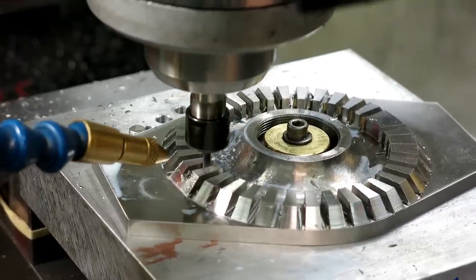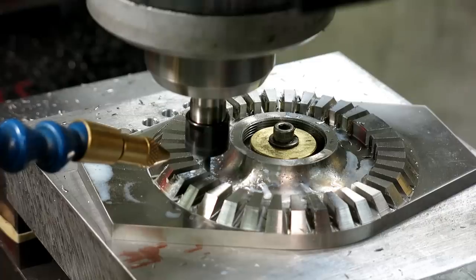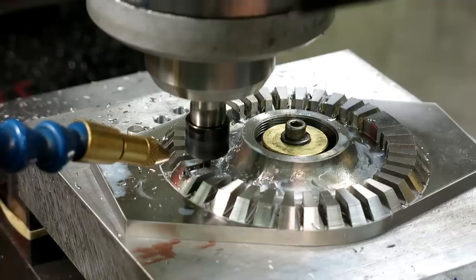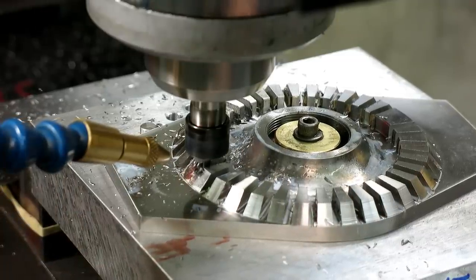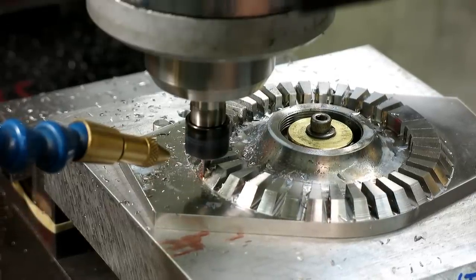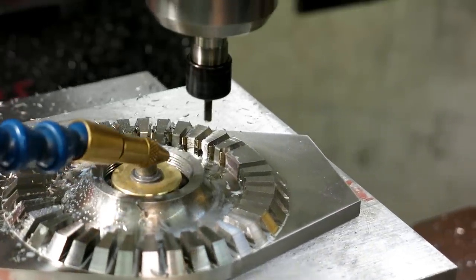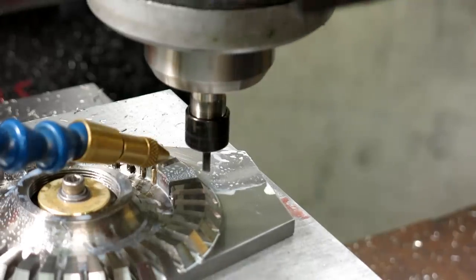But, now I actually tried cutting it full depth and it actually works, but on the actual piece here, I wanted to be a little more conservative, just in case, because I got a lot of work in this thing. Okay, so I'm taking it in two whacks, about equal depth of cut. And the chips are beautiful, just marching through that stuff. This is 304 stainless here. Maybe 316, but I think it's 304. It's actually a scrap vacuum flange that became this part.